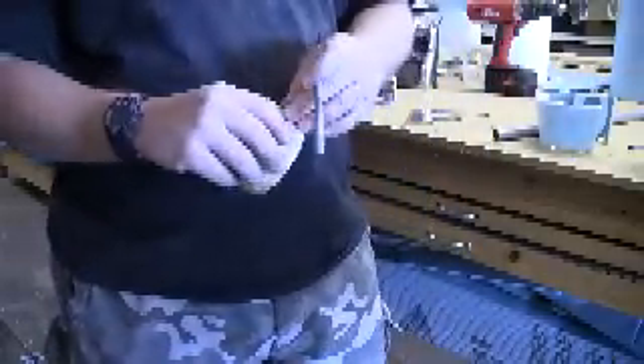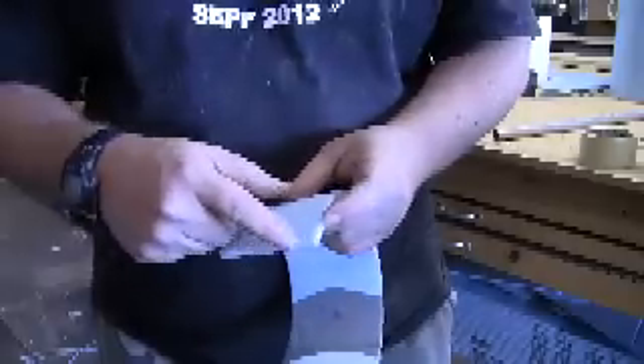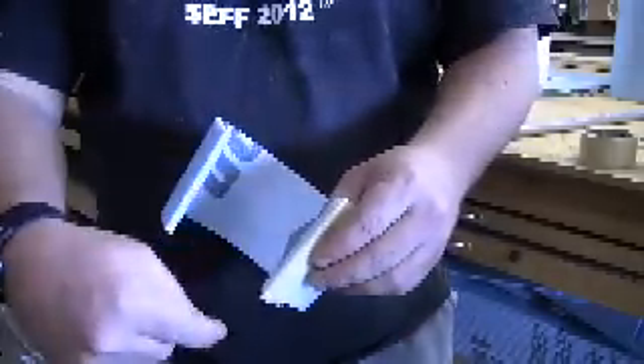So what we're going to do is take some tape. You want something with high adhesion — if you go to the local hardware store and get some painter's tape that's medium or high adhesion, that's the best stuff to use. Don't use packing tape because it won't grip well enough, and don't use cheap masking tape for the same reason. We're going to lay the tape over the end on one side, then bend the edges out. We're looking to get this outside edge flush with the other outside edge, as perfect as we can. We over-bend, line those two up just right, and then run the tape over.